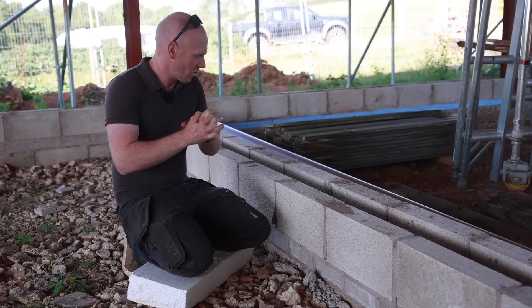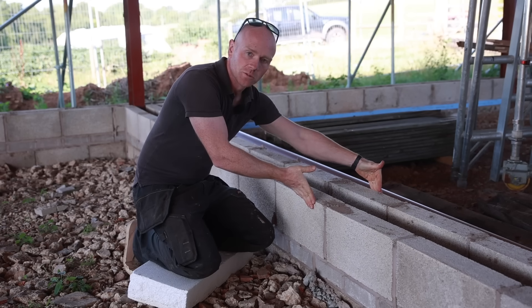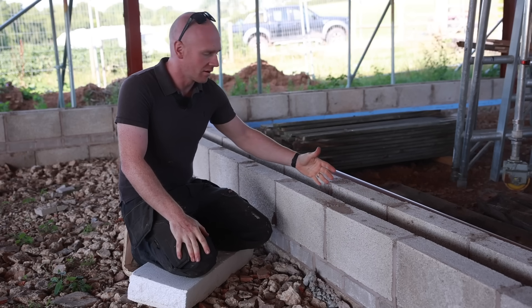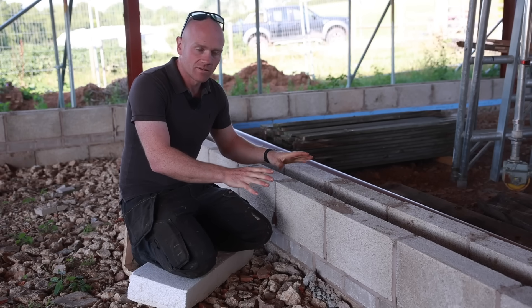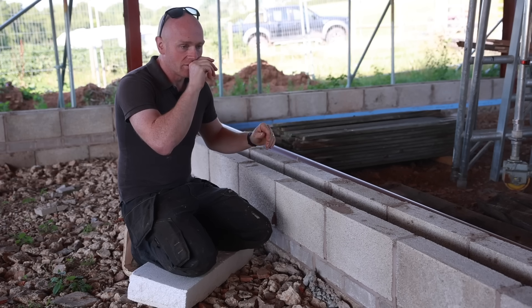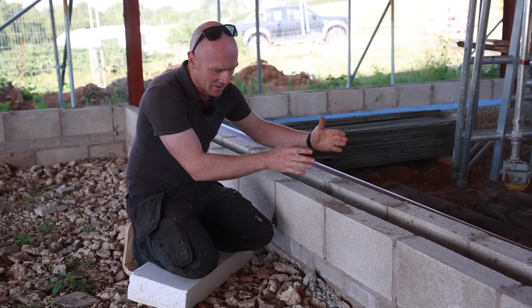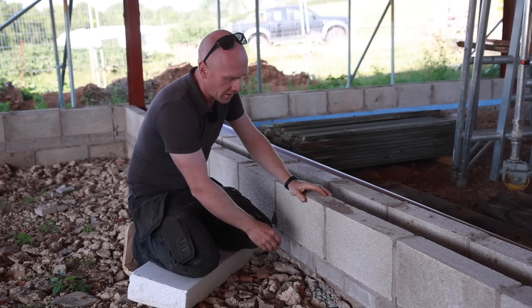I'm no bricklayer or builder but I'm going to call this a conventional cavity wall. In this case it's 300mm total and in a typical build, certainly a masonry build, this is how you would start up — you've got the ties and you'd probably be insulating this cavity. Now regardless of whether this had two storeys or three storeys of masonry on top of it, or whether it's going to have a timber frame on it like we've got, this is connected down to our footing and the concrete carries on all the way down. It could be concrete, could be brick, whatever.